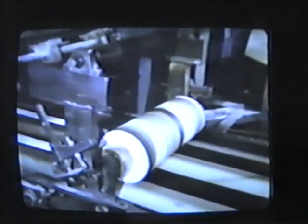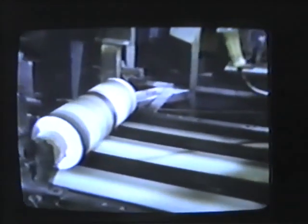Extrusion is another basic rubber process. White side walls are made as a co-extrusion of white and black rubber stocks forced through a heated steel die to shape the composite product. To protect the band of white stock during processing, it is covered with a thin layer of black stock to be ground off later. Then the hot extrusion is cooled to prevent premature vulcanization before it is packaged for tire building.